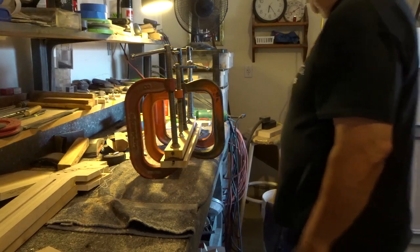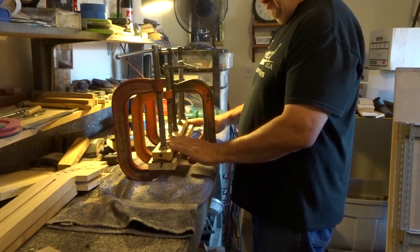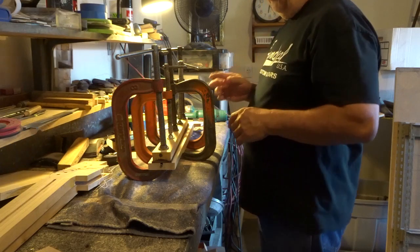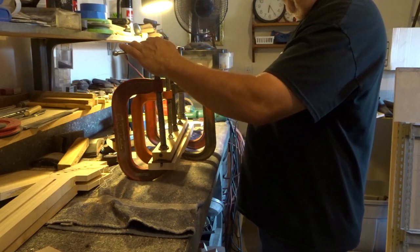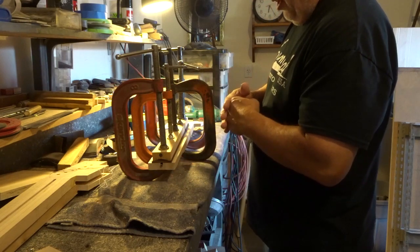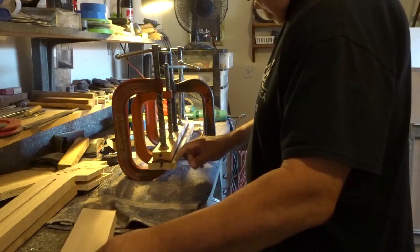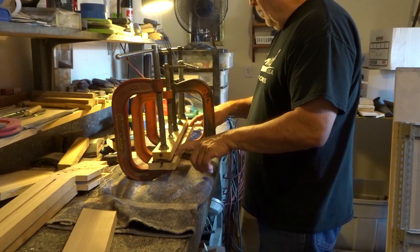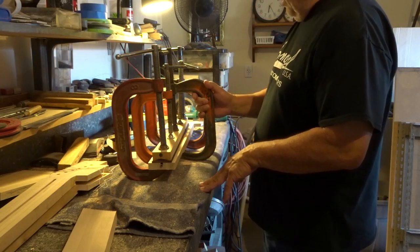Good morning. I have this neck glued up with five c-clamps and I'll explain what I did here. This is one of my necks with a rosewood fingerboard glued on. It's tricky because when you glue the fingerboard on, it's floating on glue on both surfaces and it wants to shift and move. So what I do is draw alignment lines — I flush it up here, with lines on the side — and that's what keeps the fingerboard in place.